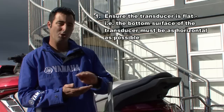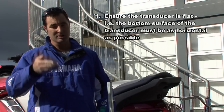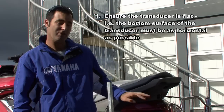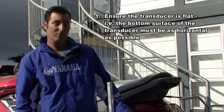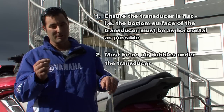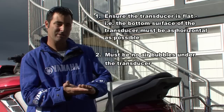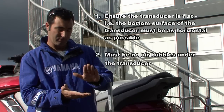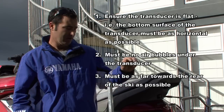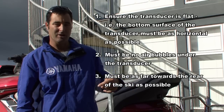Firstly, we need to get it so that it is perfectly flat, pointing straight down at the seabed. So if your hull is on a slope, that transducer needs to counteract that slope — and that's what the little base flange does with this transducer. Secondly, it needs to be able to see through the hull, meaning there can't be air bubbles or two skins with air in between — just one skin of fibreglass. Thirdly, we want to get it as far back in the ski as possible. The very back of the ski very rarely comes out of the water, so that's the bit that's going to get the best sounding as you're running.